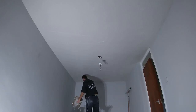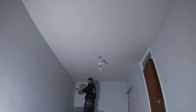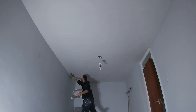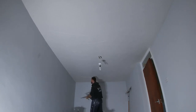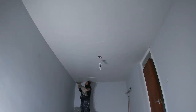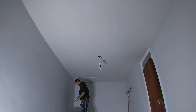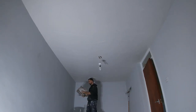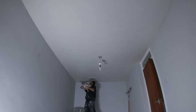You can see I'm motoring on quick enough, trying to get it on as quickly as I can while keeping it as neat as possible. The main focus on the second trowel is to leave it flat — almost like a flat nail already. That will speed you up time and time again. Every stage after this will be so much quicker if you pay attention and go as neat as you can at this stage — mark my words. Good plasterers I've learned with are on the same mindset: the neater you coat, the easier the trowel. So why give yourself more work? Get it as neat when it's soft and easy to move around.